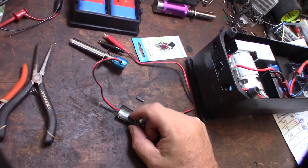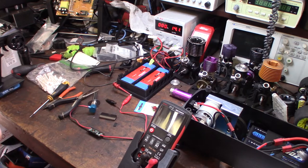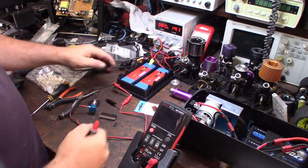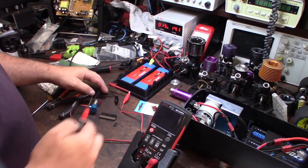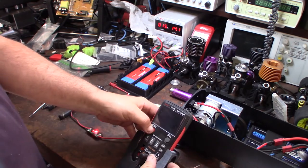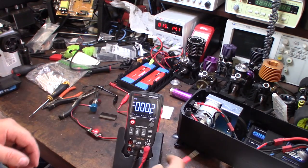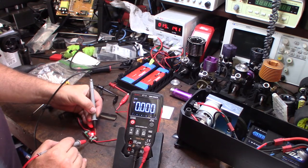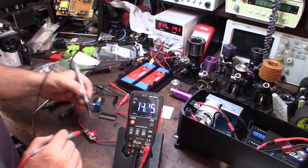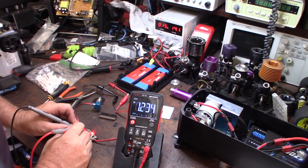So I'm going to do a quick test to make sure it's actually working. These are sometimes referred to as buck converters. So if you can see my power supply — I'm going to get this in the frame — right now I'm putting out 14.1 volts. I'm going to hook this up. As you can see we're getting power, and I want to verify that we're actually getting 14.1 volts at the input. We're getting 14.2 — it's not exact. So let's check out the output side of this, and this should be somewhere about 1.2 volts.